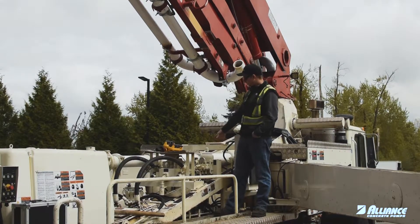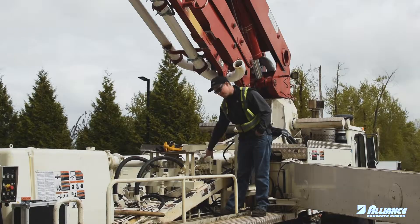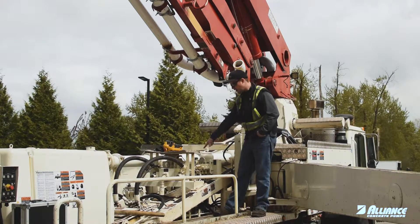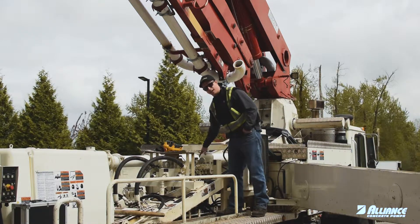This unit has a six liter accumulator bottle located right here. In front of that there's an accumulator pressure gauge. This gauge shows the current hydraulic pressure on the circuit — it's operational. We're going to show you how to check the actual pressure of the nitrogen in here.